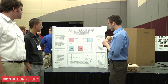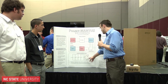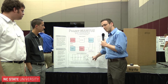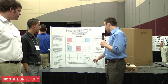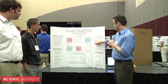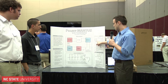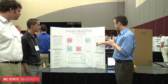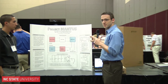Essentially what we did is we used a MOS inverter driven by a square wave to send an alternating current through our resonant coil in the mouse pad. We tuned this to resonate at around 40 kilohertz, and likewise put a secondary coil inside the mouse also tuned to resonate around 40 kilohertz. After that we have a rectifier circuit and a Zener diode to supply a steady three volts to the mouse at all times.